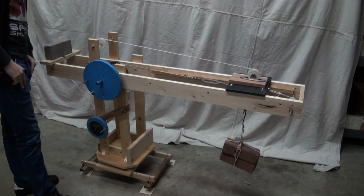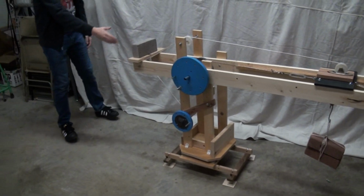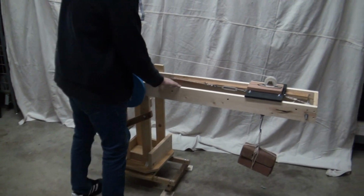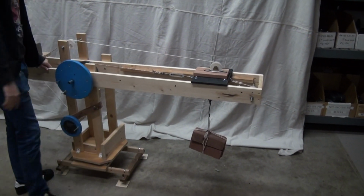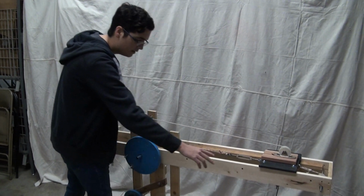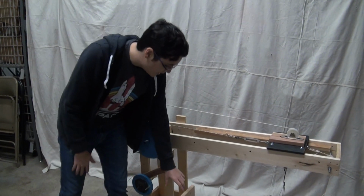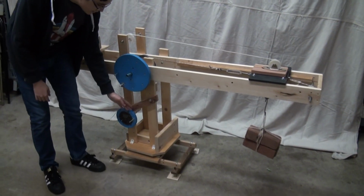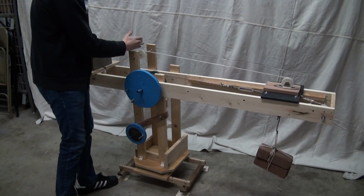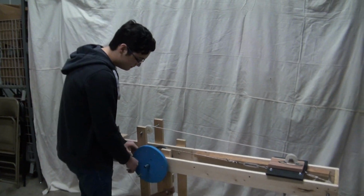Okay, so now the job is we have to land that 2-brick load somewhere over here. So we have to slew it 180 degrees. Slew means rotate. Now, when we slew it halfway, 90 degrees, what's going to happen? Well, if it's supposed to tip over here, then it most definitely will when it's rotated 90 degrees. And that's because, if you remember last time, the pivot point is closer to the center of gravity of the crane tower and the counterweight, so it reduces the torque on this side but increases the torque on this side. Exactly. So it'll tip over. Definitely.